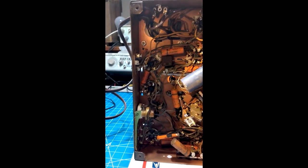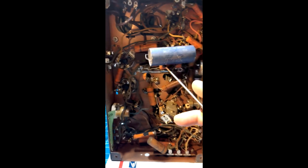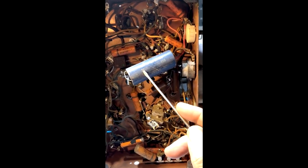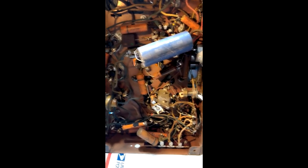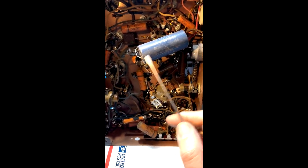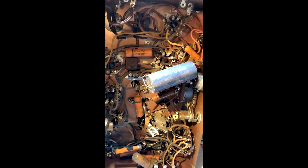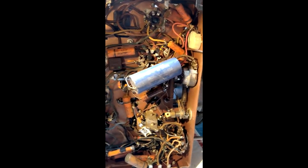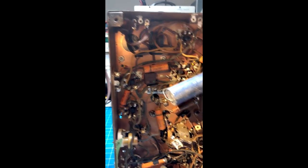The first thing is this electrolytic capacitor — it says 'dry electrolytic capacitor,' 30 microfarad at 450 volts. The voltage rating has to be higher than the radio voltage so it doesn't burn out, so it's 450 volts because the radio runs at around 370. It's connected with a cheap red wire to the center of the tone control, going into what I believe is the output tube.